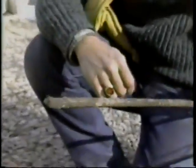How far down did you dig this hole? Me and the helper, we went down about 4.5 feet in about a 2-foot wide trench. Took us a better part of the day. Yeah, and what's this block sitting on? I hope there's a footing down there. Oh, yeah. We put down about 2.5 yards of concrete between this trench and the other one. Right down to the bottom, I guess it's about 24 inches wide and about 10 inches high. Mm-hmm. And then I threw in 4 lengths of half-inch reinforcing rod, so that's lying across the whole length of it. And we let it set for about a day before we got started on the block work.